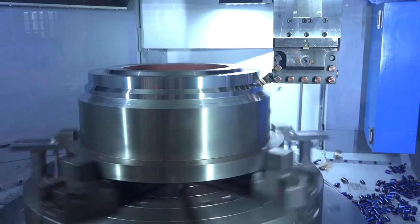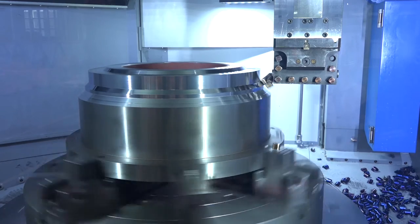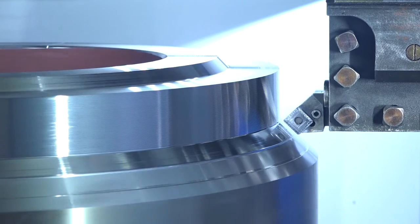It's built and manufactured to do all types of material, but its main strength is for exotic materials. You can have up to 400 bar through-the-tool coolant, which improves tool life and gives you a better surface finish on exotic materials. If you're producing an aircraft ring, without high-pressure coolant you might get three minutes of tool life, but at 400 bar you can get ten minutes — a considerable step up. Normally you're talking 70, 80, maybe 100 bar, so four times that is pretty incredible.